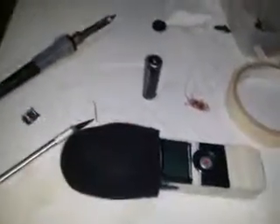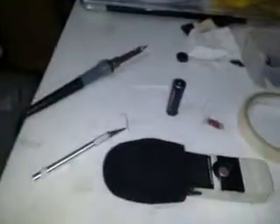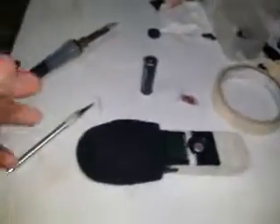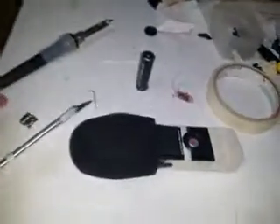From the previous video, my problem was that the SD card won't detect because I was dumb enough not to solder the shorted ground pins of this case. It should be shorted, but what I did was just let the SD card slide right through, and without any shorted ground it won't detect. I should have connected that, but I thought it was just a connection of the SD card.